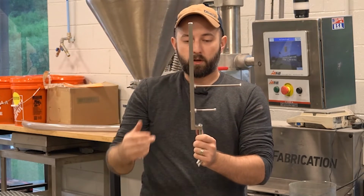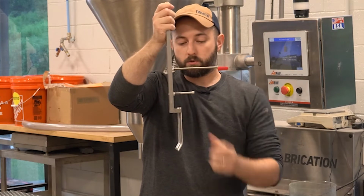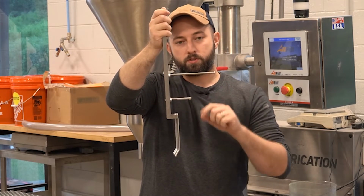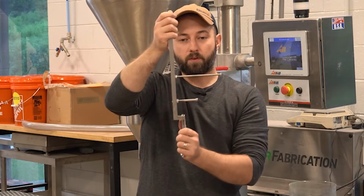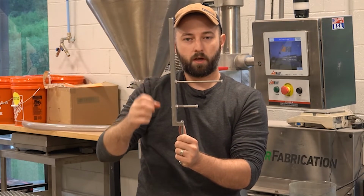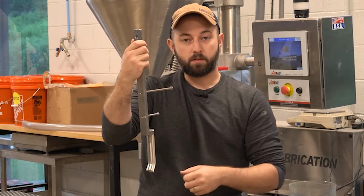But essentially what we're doing is now you've got the benefit of a flake blade hugging the auger very tightly. So you're getting that targeted agitation around the auger, but also you've reduced the surface area of the outside agitator, and you're able to cut through the material better. So these rods are super effective at cutting through that flaky light density material and getting it to move just enough that it continues to collapse, and then the flake blade can grab it and help it fall into the flights of the auger tooling.